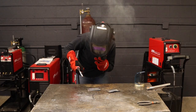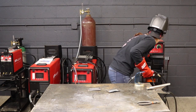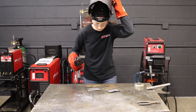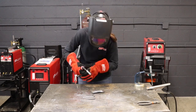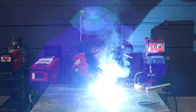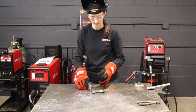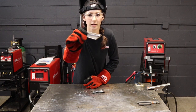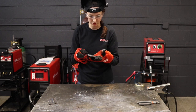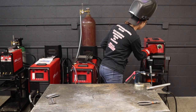I've decided to try out a couple of test welds just to make sure the machine is set how I'd like it. When I started actually welding on the rocket stove, it was determined that the machine was running too hot — many of our machines are set to standards, but they do run hot. We turned it down to the 18-gauge steel setting and the voltage up a little bit just to make sure I wasn't burning through those welds.